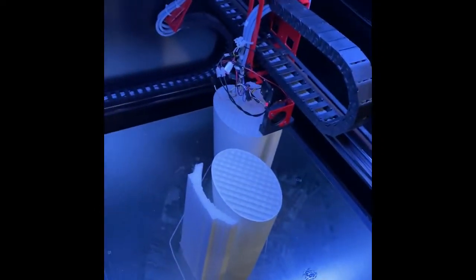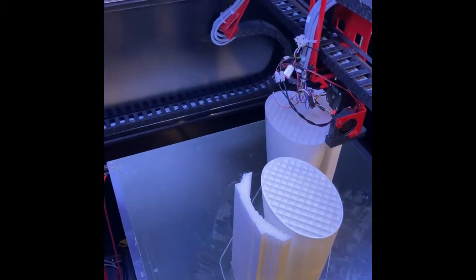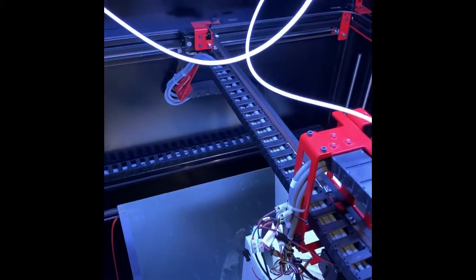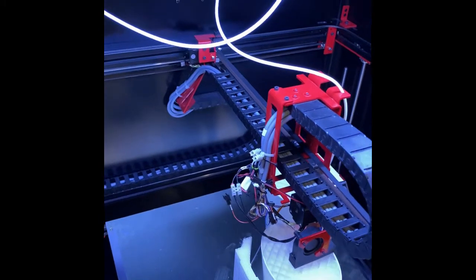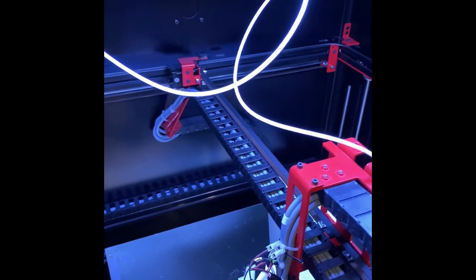Now, this heat bed generates a lot of heat and becomes your friend if you need to run your enclosure warmer for specific types of filaments, whether it be your ABS type filaments. You can do it in the Modix. I've done it and it's not a problem. And your PETGs, your PLAs, not a drama at all. At the moment I've got it equipped with the 3 kilo spool. It will handle up to a 5 kilo spool, not a drama.